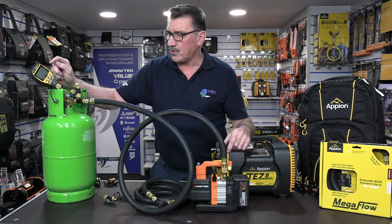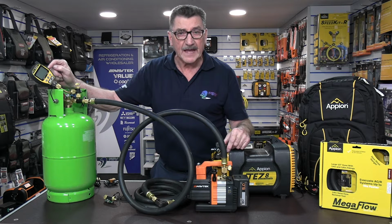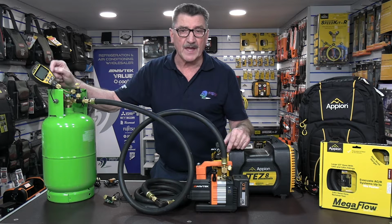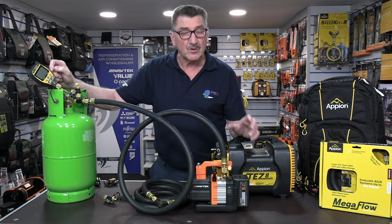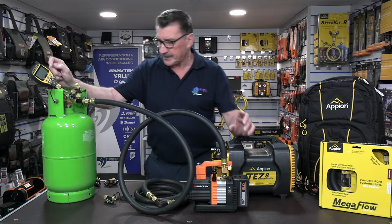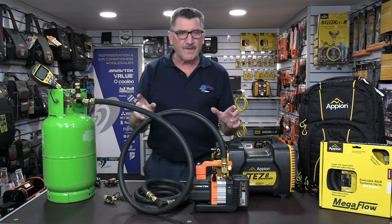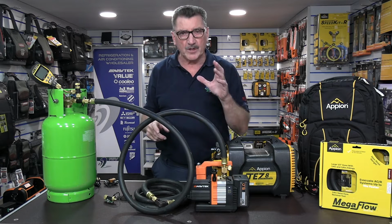Just as a little side note, the AV760 is quite capable of taking 400 psi of pressure. Most of the others will only go to about 70, and I'm not sure about every one of them, but I know the tester will only go to 70 psi, so you need to do your best to protect it, okay? So that's a single valve, a single Megaflow hose setup on a smaller vac pump.